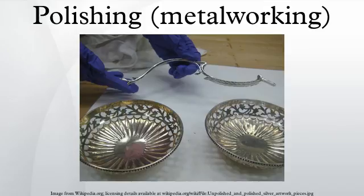The condition of the metal determines what type of abrasive will be applied. The first stage, if the material is unfinished, starts with a rough abrasive and each subsequent stage uses a finer abrasive, such as 120, 180, 220-240, 320, 400 and higher grit abrasives, until the desired finish is achieved. The rough passes remove imperfections within the metal surface like pits, nicks, lines and scratches. The finer abrasives leave progressively finer lines that are not visible to the naked eye.